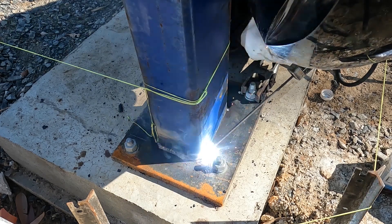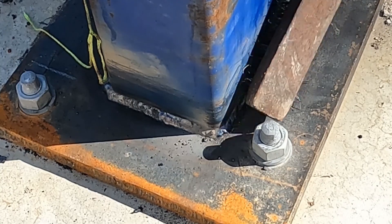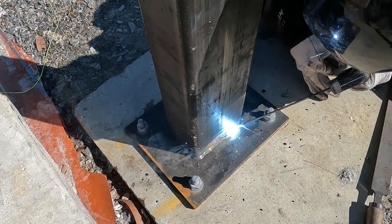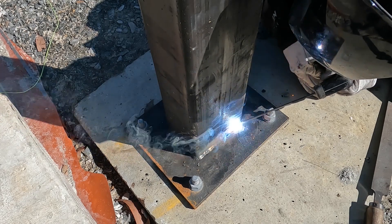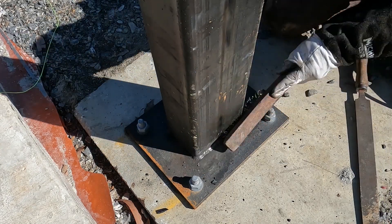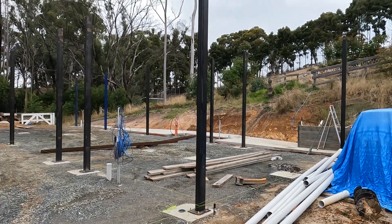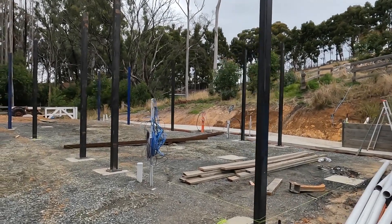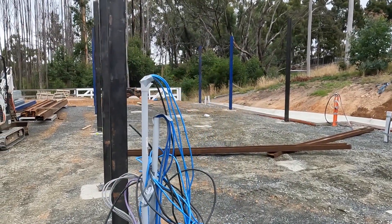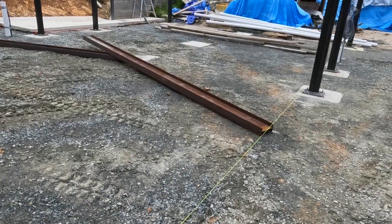On this one I weld about two inches here, then cross over to the other side, and just went around and finally finished welding all of them. This is the thicker beam — running about 130 amps with a 3.2mm rod. Really happy with that — it's definitely nice and solid. All the columns are up for the main area; I still have the lean-to section to do at a later date. The next stage is going to be starting to work on the trusses for the main area, which will be those I-beams. If you have any questions, put them down in the comments and I'll see you in the next video.